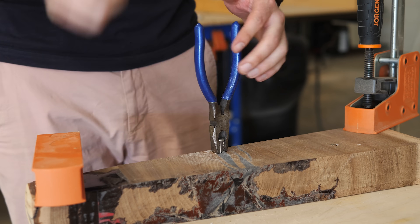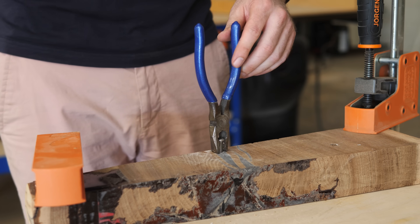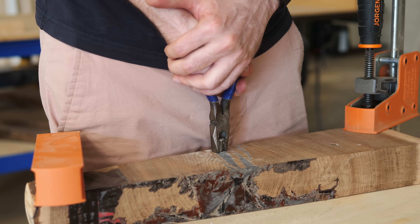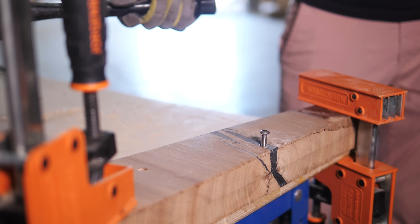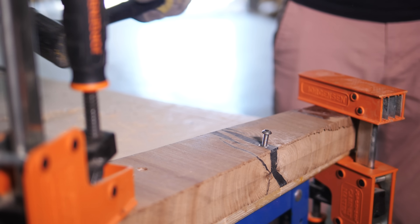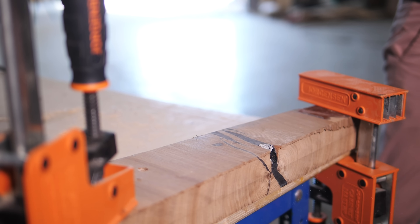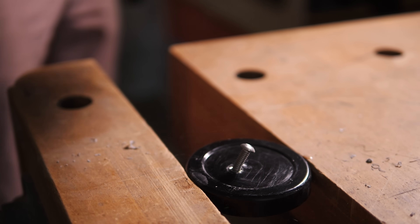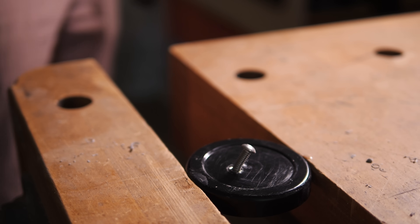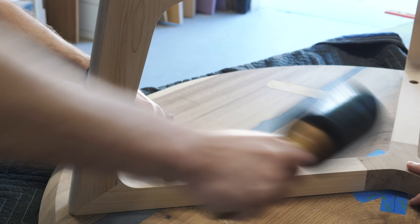What you're seeing in this shot is probably the most critical test. Really the only force these bolts are ever going to be subject to is if somebody were to lift the table by the top and the weight of the base was hanging from the bolts. The force I'm pulling up with here is way more than the weight of the base. That said, I decided to break it with a hammer — and this was probably a bad test because the threaded insert was too close to the edge of the piece, so it wasn't that hard to bust through. Next I installed a threaded insert into a puck of epoxy that had cured in one of our cups, which is much more accurate to what will actually be on the underside of the table. After watching this, you can see why I'm not at all concerned — the entire bolt bent and the threaded insert stayed in. So this thing's strong.